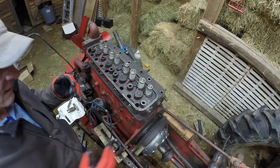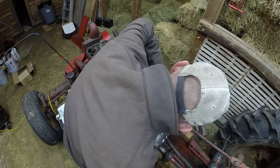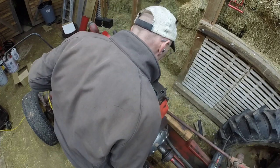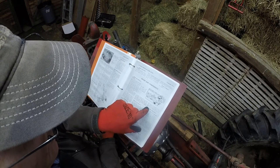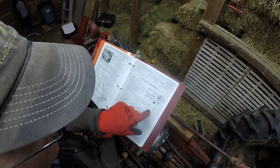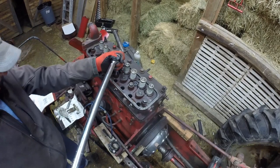Okay, now let me get my head gasket resituated here because it's not in a happy spot. And grab some head bolts. And torque this thing down to 110 foot-pounds. On model 33, 130 to 140. Yeah, 100 to 110 foot-pounds. All right, 75 to 95 to 105.